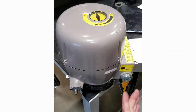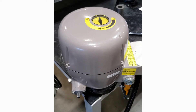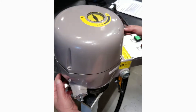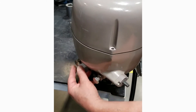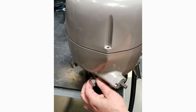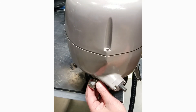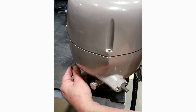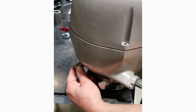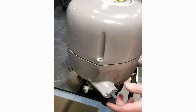Setting the mechanical stops on an F2 actuator means we're going to limit the physical travel of the actuator's gear mechanism with the two stop bolts on the back of the actuator. The bolt closest to the hand wheel is the closed stop and it will limit the clockwise direction travel. The other screw on the back side is the open physical travel stop and it will limit the counterclockwise travel of the drive shaft.